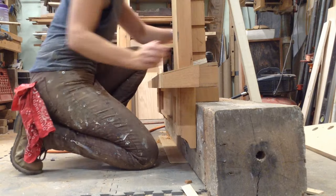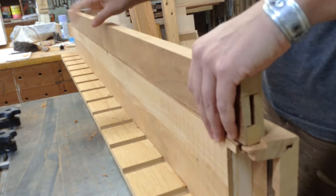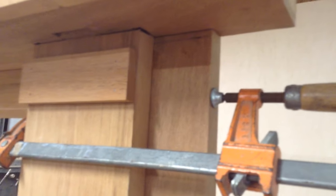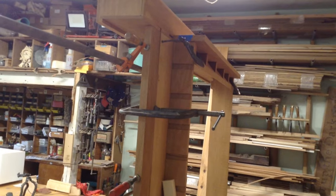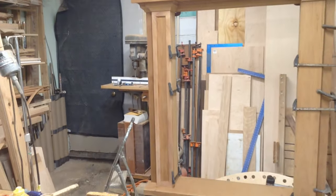Now the sill lines up with my space from the back, with the edges, and with the decorative sill for the top. I put my pilasters back in place. I had to move my reference block three-quarters of an inch forward, but the engaged pilasters were now too far back. What I decided to do was make a groove in the pilasters so the engaged pilasters fit into that groove and everything sits in place. My original mortises in the cornice were in the right spot, so I moved those back. The engaged pilaster was a little too short so I added a piece on top and glued that in place. Luckily everything is getting crowned up there, so the shim I added and the wrong mortise holes will all get covered with crown.